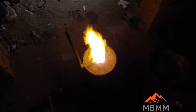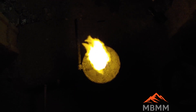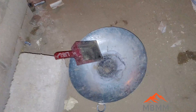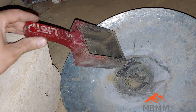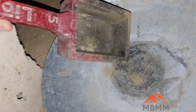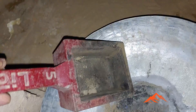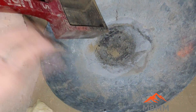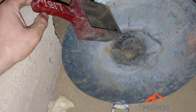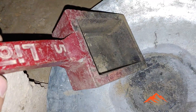The sun's gone down and we've roasted our material. It's in the furnace in a small probably number two or number three crucible. We don't have a cone mold here so we're going to use a bar mold tipped at about 45 degrees to try and get a cone down in the corner. It's probably a five kilogram bar mold — we've got a steel pan underneath in case any slag overflows. Hopefully our gold will go right down to the bottom in the cone.